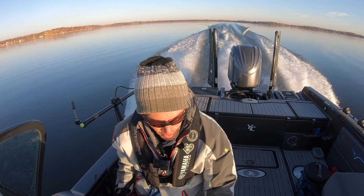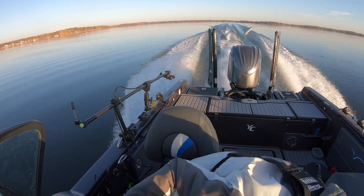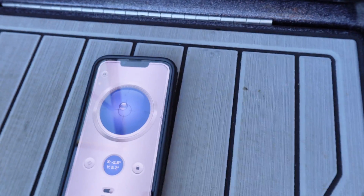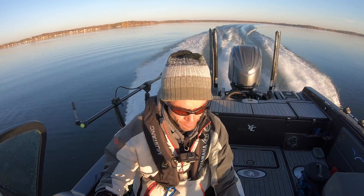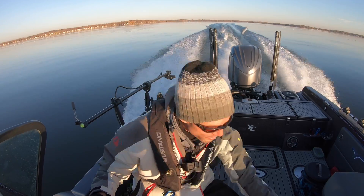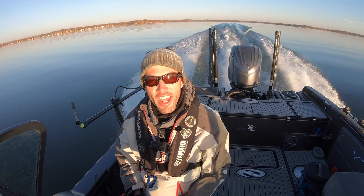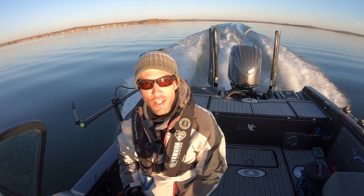You can even take a look right here — I've got the perfect running pitch right there, 5 degrees. I'm pretty level and I can change my roll a little bit. That's right where I want to be, that's perfect. So there you have it: push a button and control how your boat likes to run. Just find that happy spot and get the controller mounted in the right spot to begin with.